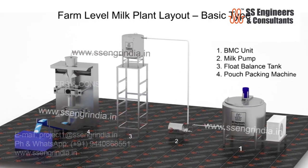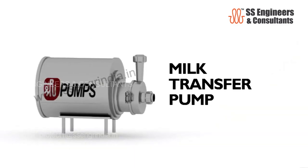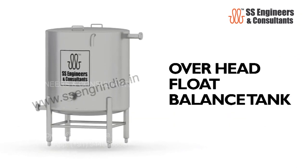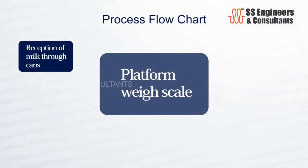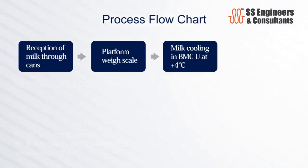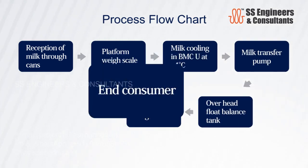Farm level milk plant layout, basic type. Bulk milk cooling unit. Milk transfer pump. Overhead float balanced tank. Pouch packing machine. Process flowchart. Reception of milk through cans. Platform weigh scale. Milk cooling in bulk milk cooling unit at +4 degrees Celsius. Milk transfer pump. Overhead float balanced tank. Milk sachet filling machine. End consumer.